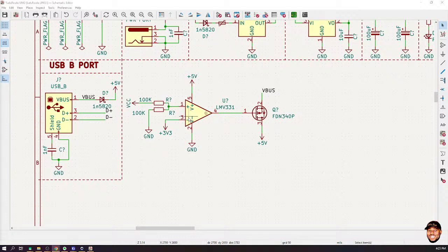Mr. Obeng, I'm a bit confused now. Does the comparator amplify the difference between the inputs, or does it select whether 5 volts or ground, based on the inputs? It compares the input and switches. For now, just take it like that, so that I don't get confused again. It is switching between these two values. So for now, just take it as if whichever is higher, it selects the associated voltage. Don't confuse yourself with more detail.